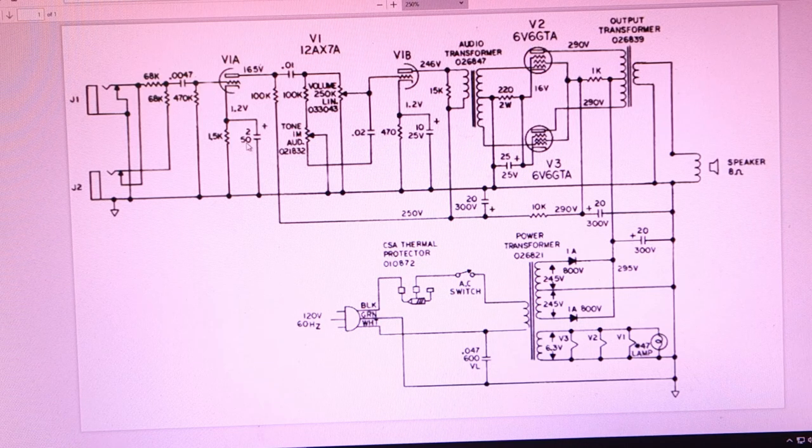So we have 525-volt, 2 microfarad, and 10 microfarad caps. We were able to find all of the original-ish capacitor values and we're good. Apparently there was a later version of this that came out in the late 70s that had 6BQ5s — AKA EL84 tubes. That should have had similar performance. And I guess they changed the reservoir caps — instead of 20s I think they put like a 70 in there or something, maybe to give it a little more oomph. Let's put her back together and see how it sounds.